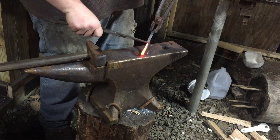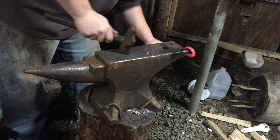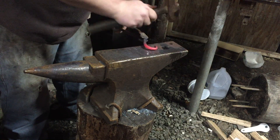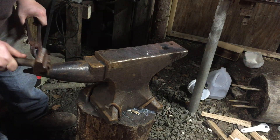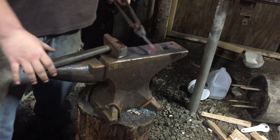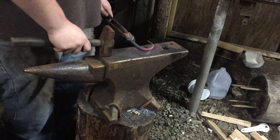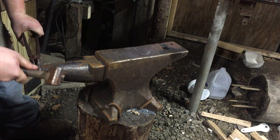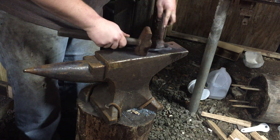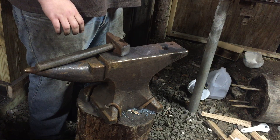I've got some yellow heat and I start it there. I hit it downwards like this to get more material to bend over, then I go and close it. Make sure it's closed, or there's a good chance it will hook onto whatever fabric is hanging on it. I think it's more beautiful closed. That's a bit of a small scroll but you get the idea — I'm trying to hurry for the camera. Now we'll do the little sit-down on the end here for the mounting plate, as I call it.